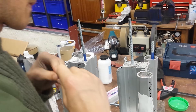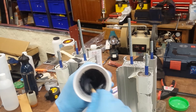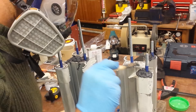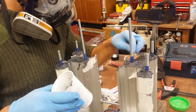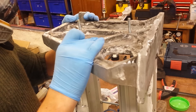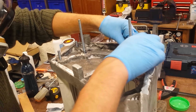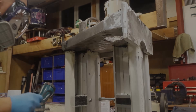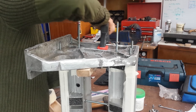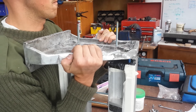Here's where the process of replication with the metallised epoxy really comes into its own. I would have had to spend a very long time machining the surfaces of those plates flat, but instead I can just use this epoxy putty. It's going to stick to the end of the gantry that I roughened up, and it'll conform and match exactly to the inside of the gantry plates. In an ideal case, this leaves you with a joint that has better surface contact than if it was a ground finish on both sides.